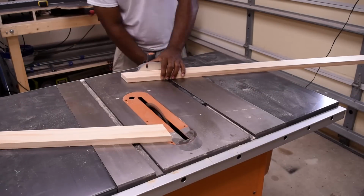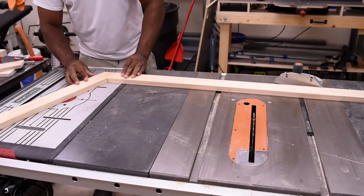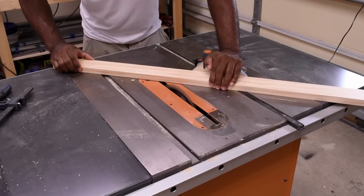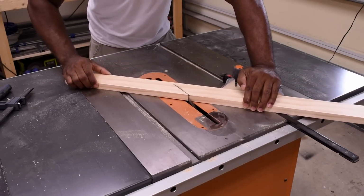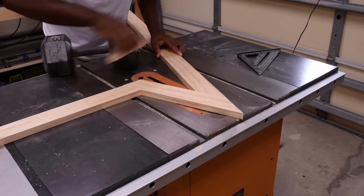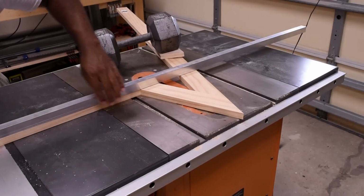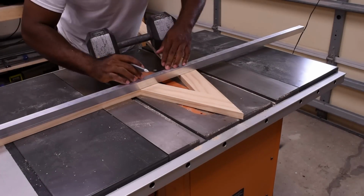I made my first cut at 30 inches for the trim using 1x3 pine. I lined up the two trim and made a mark. Then I set the miter gauge to 50 degrees for the second cut. After every cut, I set up the trim just to give me a visual that I was on the right path. And the next bend I need to make in the trim has to be parallel to the first cut.